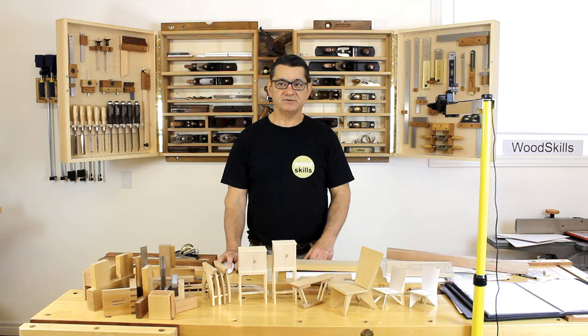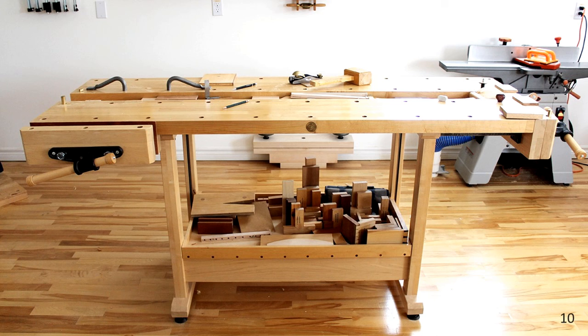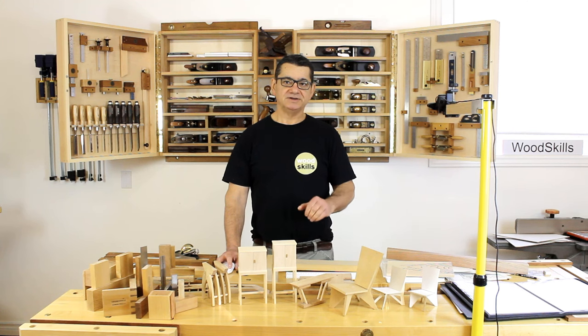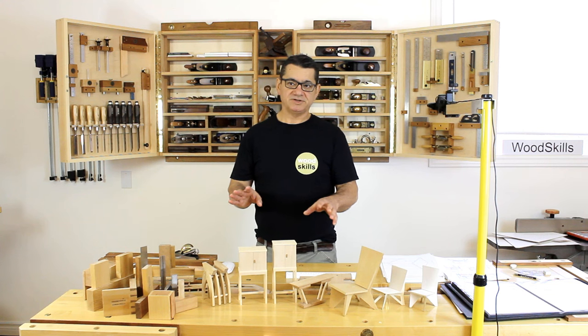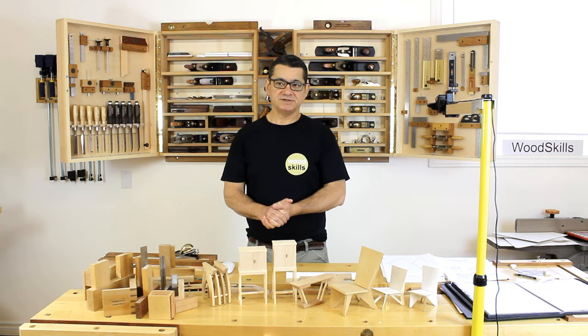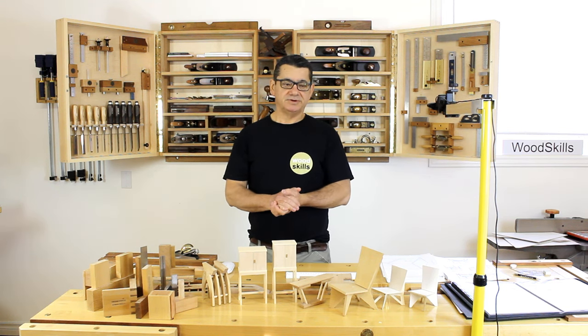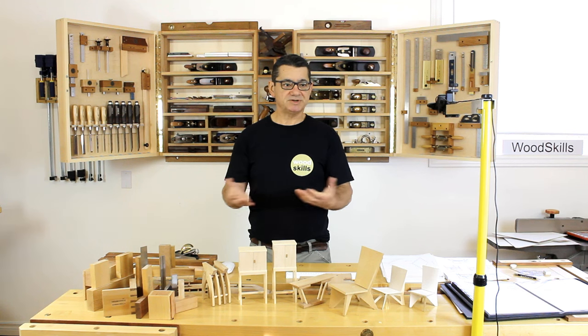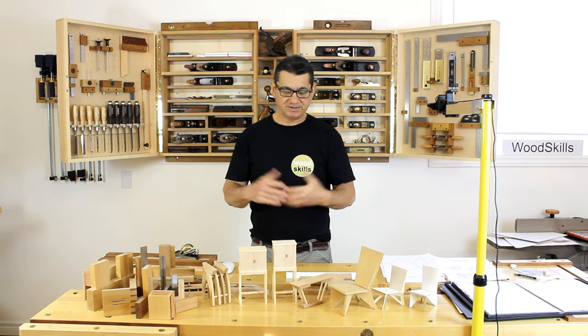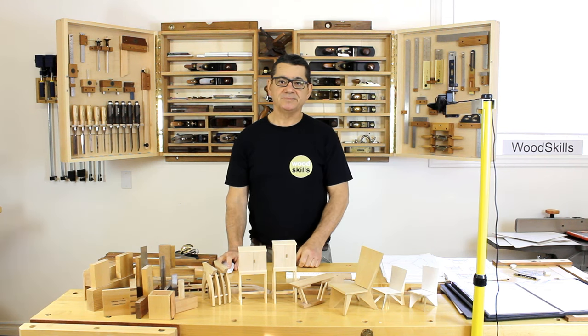This is an example of workflow: machines against the walls, work benches away from the walls, and the table saw centrally mounted so I have maximum access around it for larger pieces of wood, sheet goods, and that sort of thing. I also need to keep in mind that when creating furniture you need room to maneuver large case goods and cabinets — I have a rolling cart, and I need plenty of room around machines to work correctly.